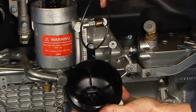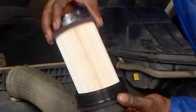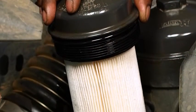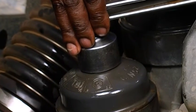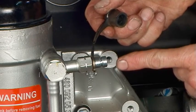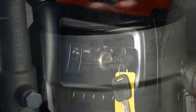Remove the old O-ring from the cap. Clean the cap and housing with a clean cloth. To install, fit the new gasket or O-ring in the cap. Place the new filter cartridge into the cap and install a new gasket on the base if one is required. Reinstall the cap with the filter cartridge and tighten the cap to proper torque per icon instructions if present, or follow manufacturer's guidelines. Prime the fuel system by following system priming instructions to remove all air. After installation, start the engine and check for leaks.